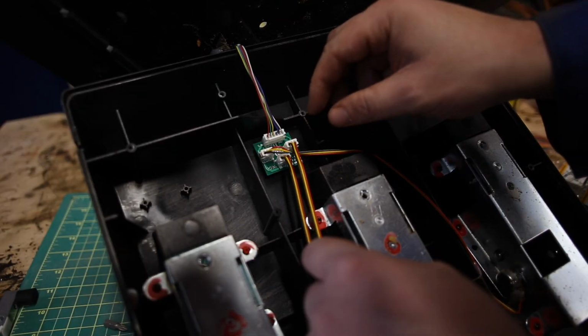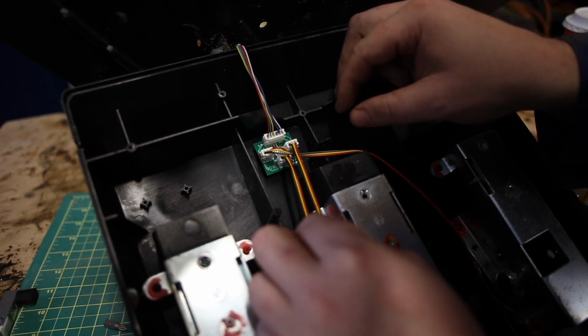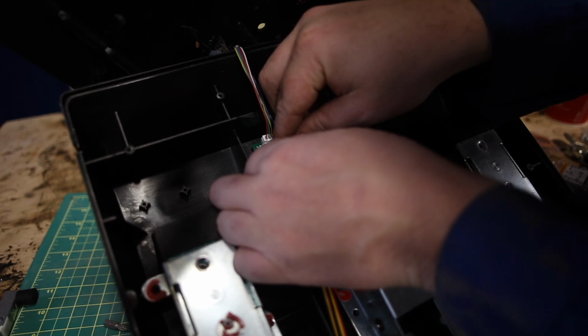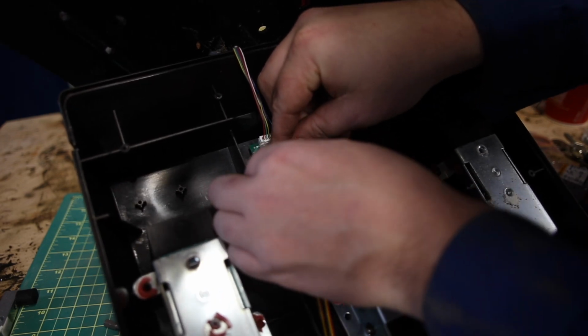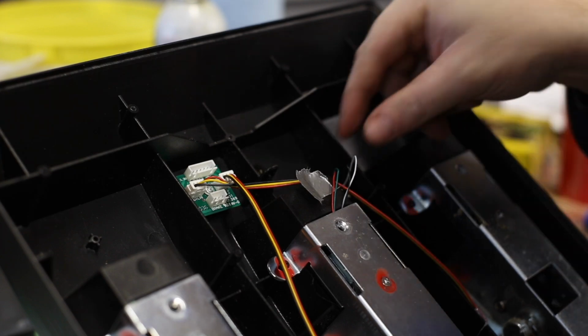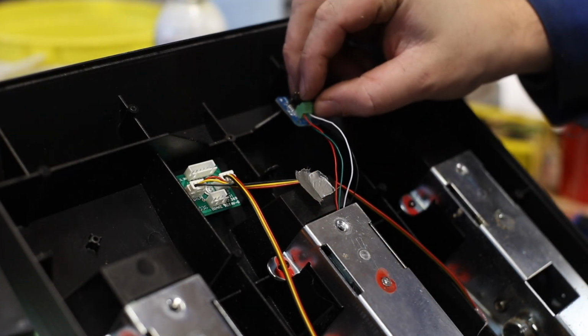You unplug the brake cable, which is the lower cable. Next, you have to attach the board somewhere within the pedals. I used Gorilla Glue, but I suggest something like hot glue that dries a bit faster. I just didn't have hot glue on hand.